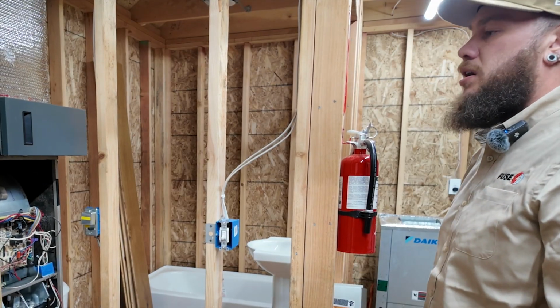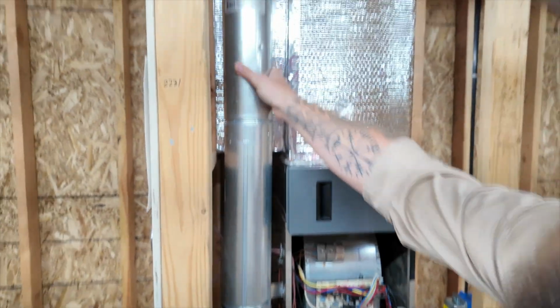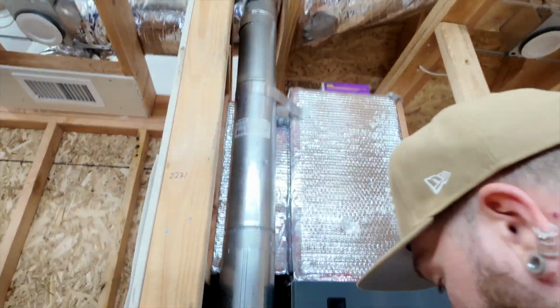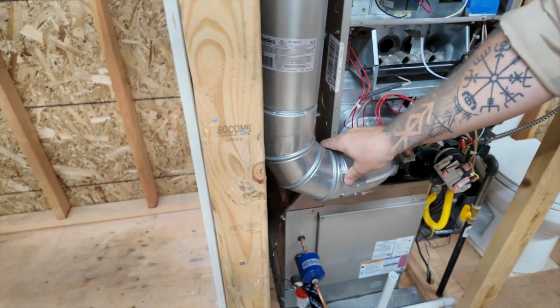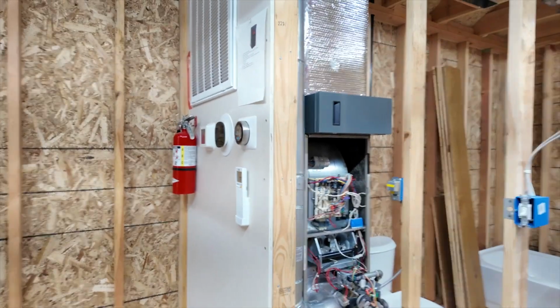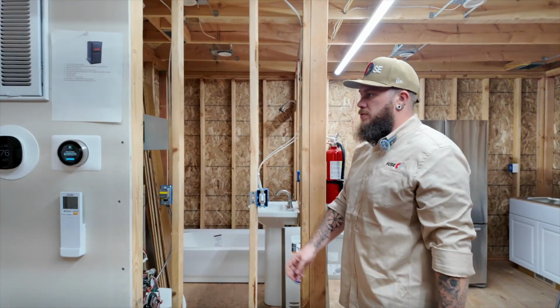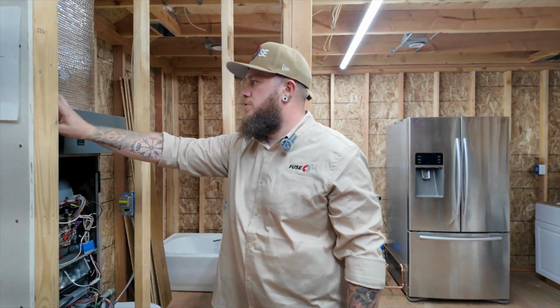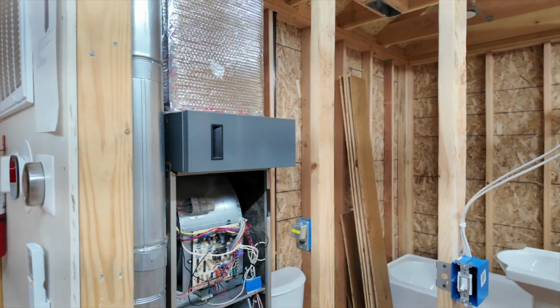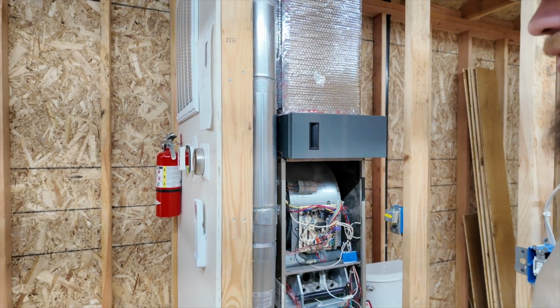So also we check the exhaust pipe just to be sure that everything is connected and attached properly, nothing is wobbling, everything nice and secure, because we're living in an earthquake zone and everything is moving in our houses all the time. So just to be sure that everything is connected, because inside this pipe you have the most dangerous thing of the furnace, which is your carbon monoxide exhaust. If you have leakage from the pipe, it means your carbon monoxide goes inside your house.